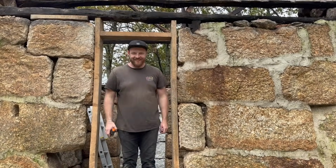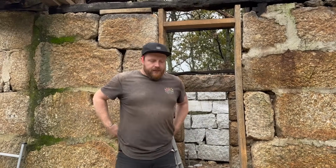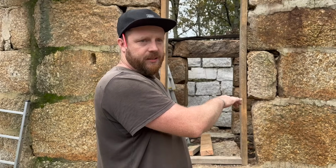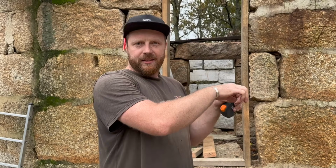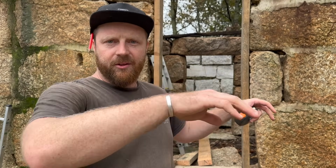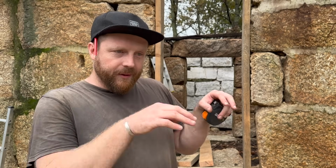Right, so we've gathered all the stuff all morning, getting the cement, mixer, the wood, sand and everything. So we're going to put a sole plate on, which is across these granite stones which you saw put in for our kitchen extension. We're going to put a timber sole plate, which is just bedded down on sand and cement and perfectly level all the way around, and then mechanically fixed at every kind of 600. And that just locks all of the granite stones together, but it also gives a perfectly level surface to start our walls on.